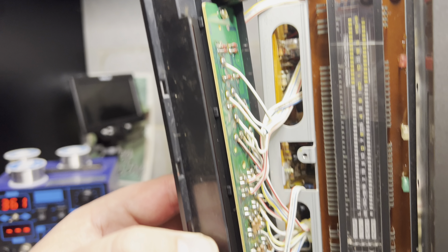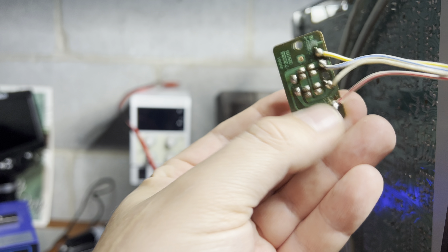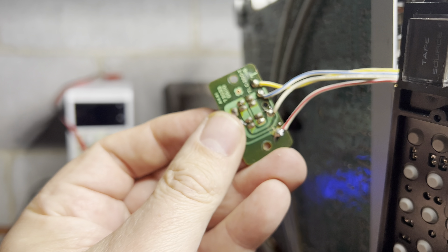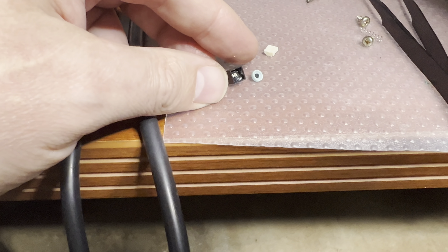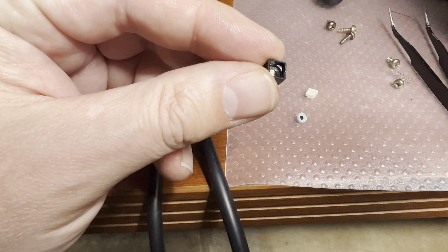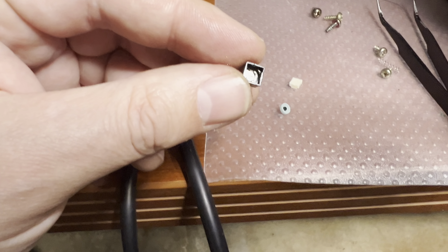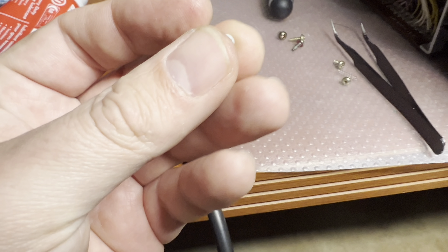Very different manufacturing culture — all those wires. I was able to pull this wire and fix it — it's connected now. Now I'll be desoldering and disassembling this button right here. Here are the button internals — these two pins, if they look golden I'll be deoxidizing them. This is what pushes them — this small tiny piece right here.